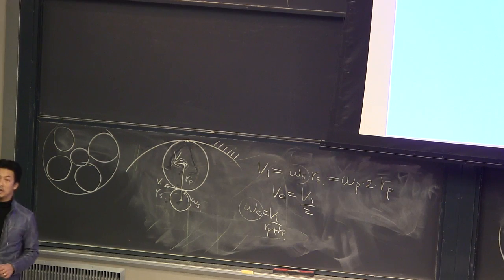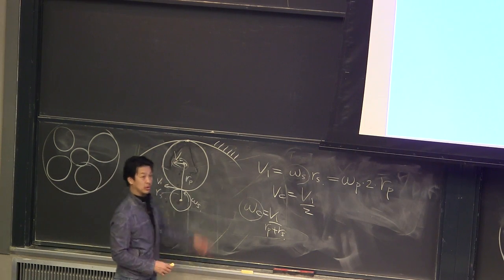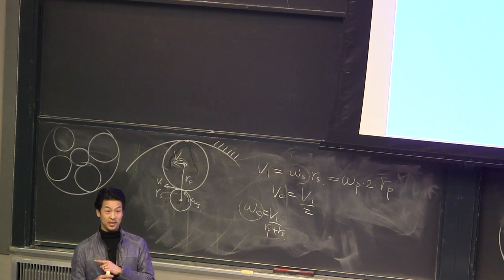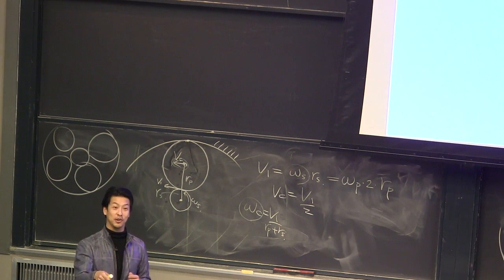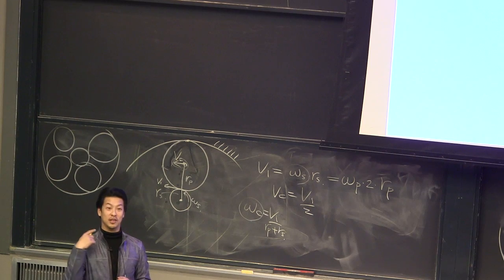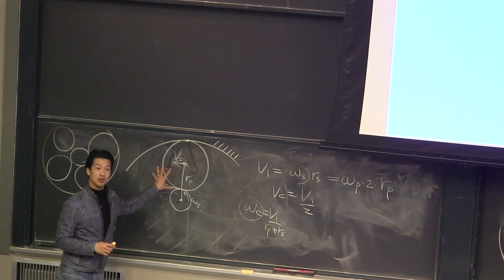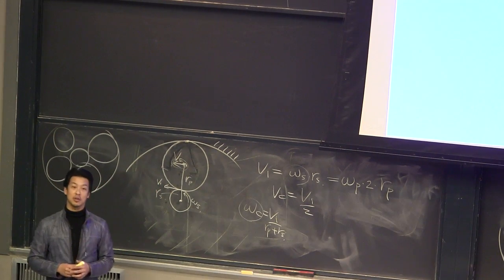Okay? And then once you know the angular velocity ratio, your torque ratio is the inverse, right? If you get faster, you get weaker. If you get slower, you get stronger. Okay? Same virtual work. I wish you can use it in your design. This is the last part of the whole lecture.